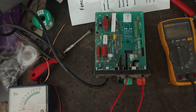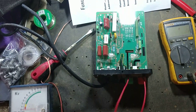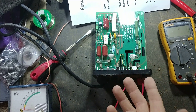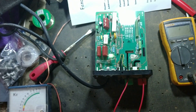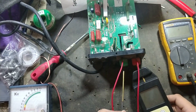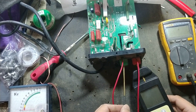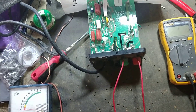I'm going to turn the light on so I can see this meter. It's going to give me my output joules as well as my voltage at that particular load. I've got a 150 ohm load on it. I'll turn the meter on, switch it to joules, and go across it. Reading 1.3 output joules at 3.5 kV — about 1.4 joules. So we're going to see if we can increase the joule output on this unit.